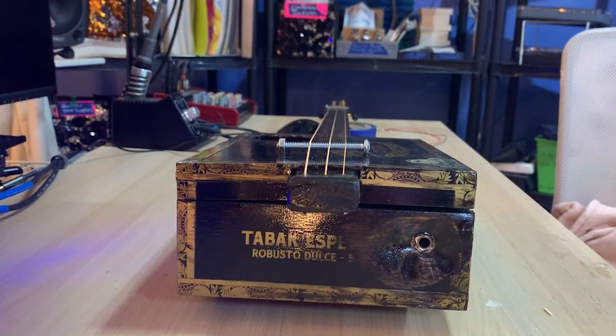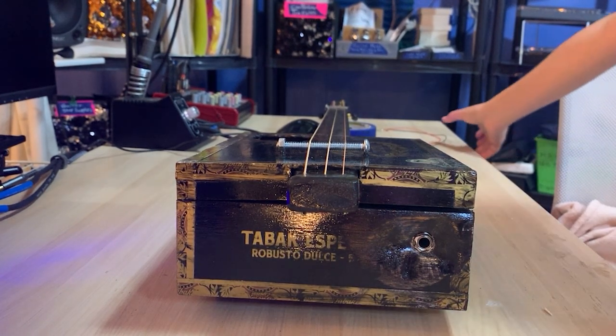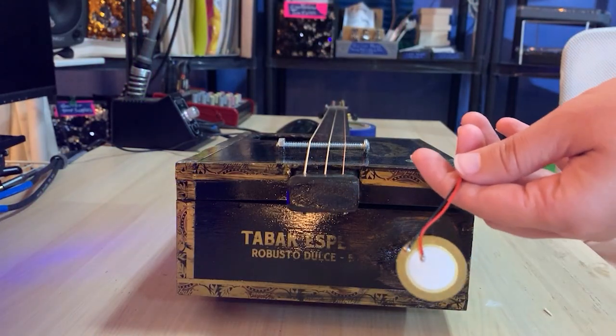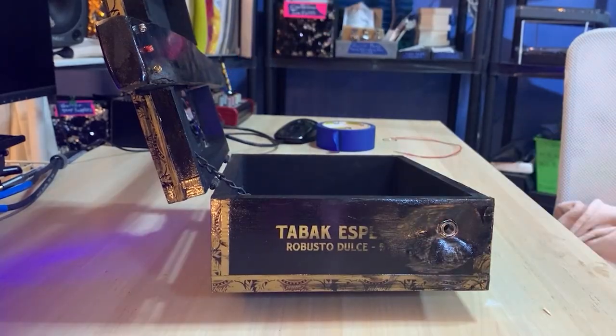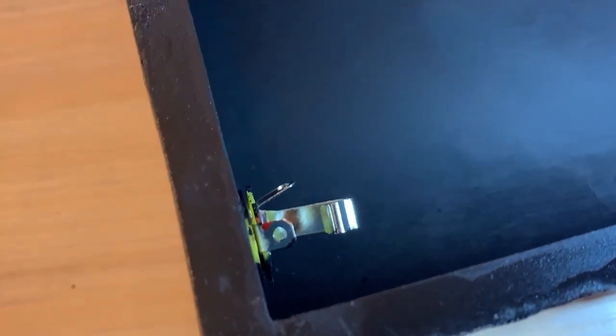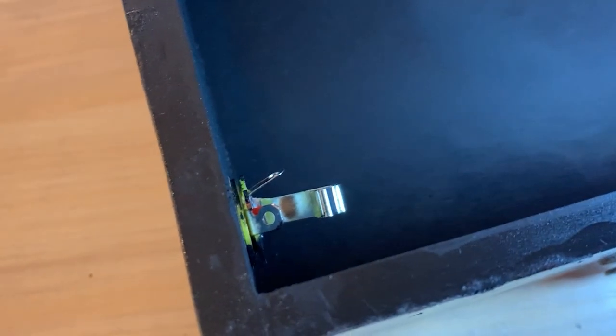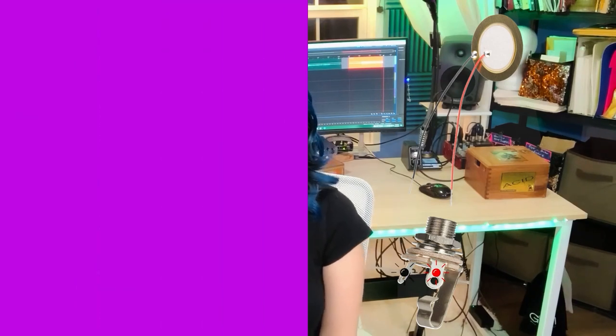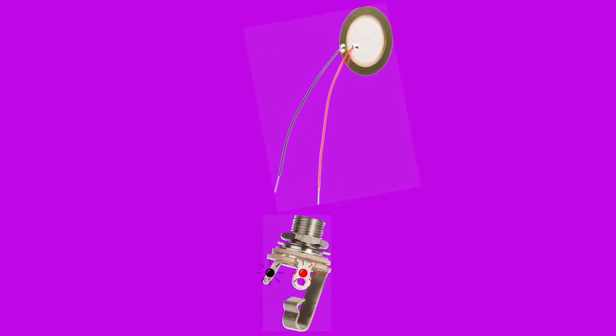You can see that I've already fitted my box with an audio output jack. I used a 5/16th drill bit to cut out the hole for the jack, and then I used a sander to thin out the wood around the jack's opening, which needs to be flush with the wood. Now I need to solder my piezo disc's leads onto the correct conductors on the jack. I marked the signal conductor with a red dot. This is the signal conductor because it is sandwiched between two pieces of plastic and is directly connected to the long tip conductor of the output jack. This conductor gets soldered onto the piezo's red lead. The other piece of metal is the jack's ground conductor and it gets soldered onto the piezo's black lead.